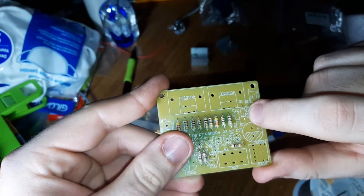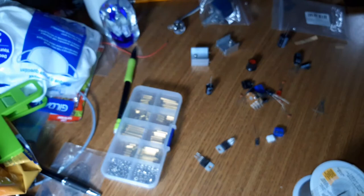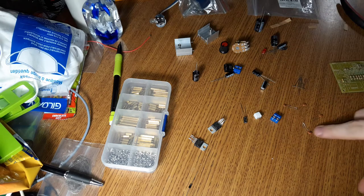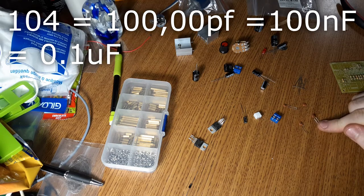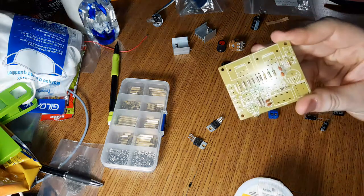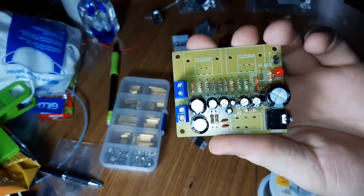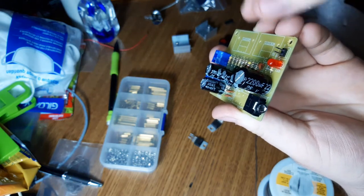I went ahead and linked out the wimpy little rectifier diode — dropping it at least twice is recommended procedure for proper kit assembly. Next are the four ceramic caps, all marked 104, which is 0.1 µF — those are coupling caps. Now the shiny ceramics are in; on to electrolytics. We have four different cap values but they're all marked on the board. I also put in the input jack, the LED, the larger caps, the speaker terminals, and switched the power header to male jumpers with a female plug on the end.